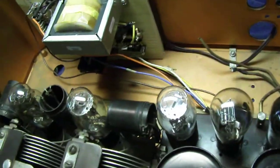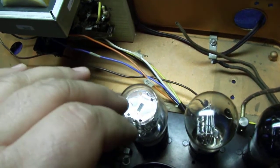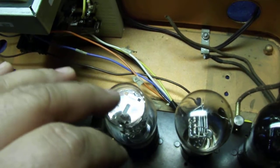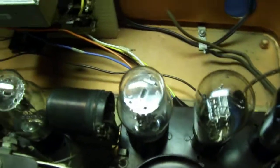Basically, it's a bit different. On this tube socket where the 27 normally goes, you've got to take the 27 base, take apart a 30, and then put the wires in the right area of the pins, which effectively works just as a plain 4-pin type 30.